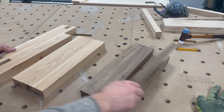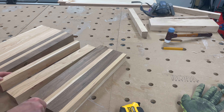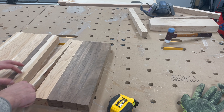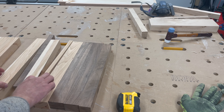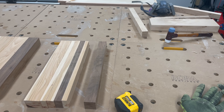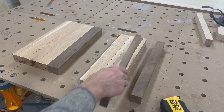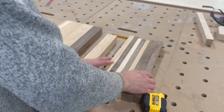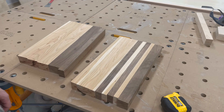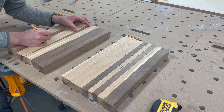Now that we have all pieces cut to rough widths, let's lay out the boards. This is the same process you'd go through for any panel glue up. For cutting boards, I focus more on which side I want on top of the finished board than on grain direction of each individual piece. Given they are small boards with lots of glue, the risk of major warping or cupping is pretty small. It's more important to have a pleasant grain pattern and ensure knots or voids don't end up on the top. I try to use pieces free of major issues, but I'll fill small spots with CA glue after sanding — though not on the top, since CA glue could chip out when boards are being cut on.